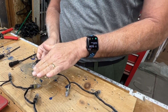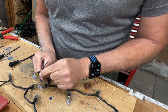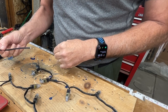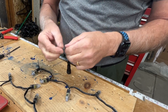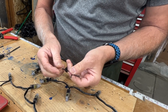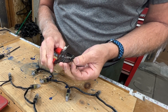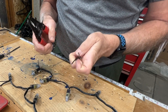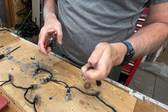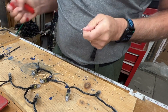I've cut myself a string of 14 pixels. This is an input, so I'm going to take this male end and connect it to that. These pigtails come with a little stub of wire and a little solder on it, which I really like — it makes it easier. I like using the solder sleeves, so I'm going to strip off just a little bit more wire to get inside and make contact with the solder when I solder to the pixels.